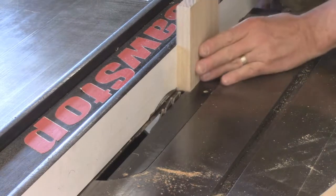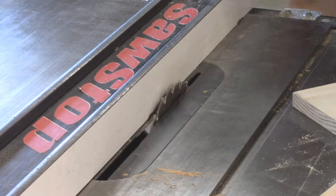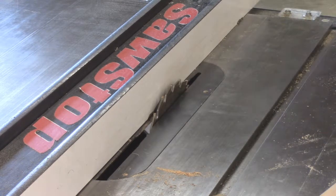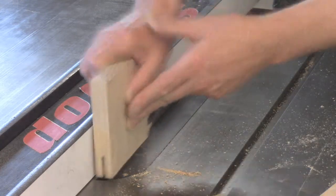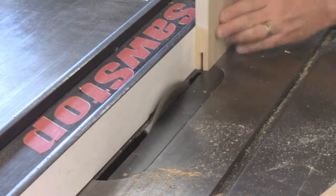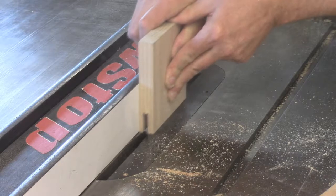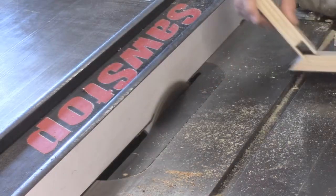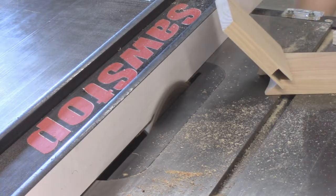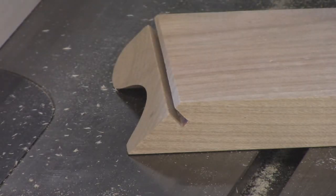Now I want to show you how I make the splines for this. These are two pieces of material that's about 1 inch wider than the molding. And I'm going to bring this blade up to where it's over 5/8. So, flip it around, and work it out. To cut these off, I'll just go over to the bandsaw, set it for a little bit less than 5/8 and cut them off. I don't want to do that on the table saw here, that'd be a little too dangerous. But these will just be slid off and that will give me the 2 splines.